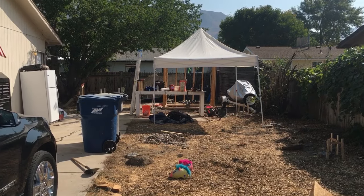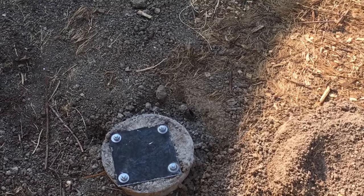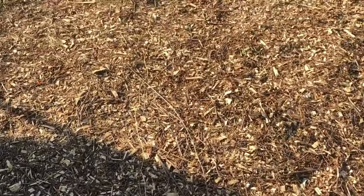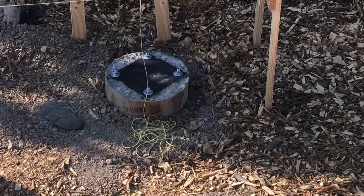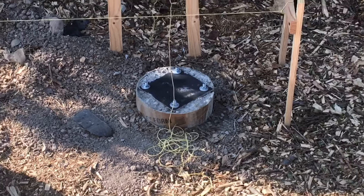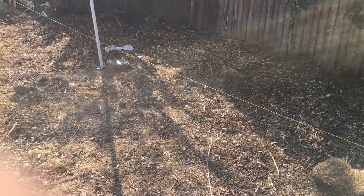In this video I'm going to be building a carport next to my house. I started by digging 9 holes in which I inserted a 12 inch tube that I filled with concrete, and inserted 10 inch bolts, 4 of them, through a face plate which I will be welding the vertical beams to.